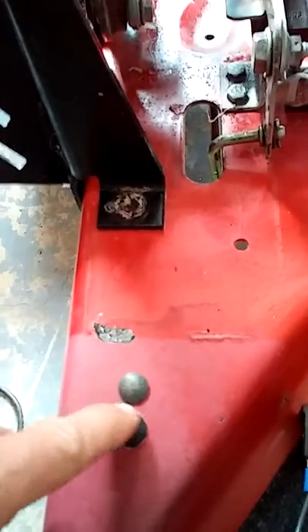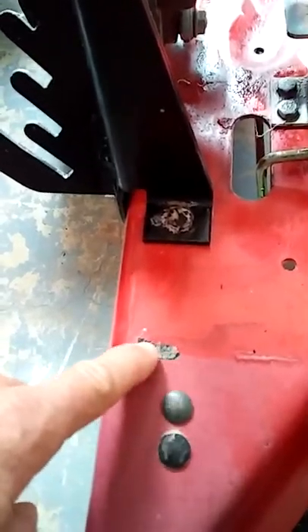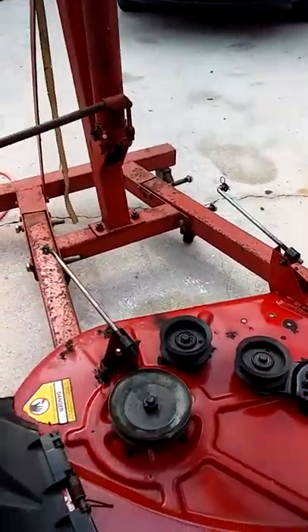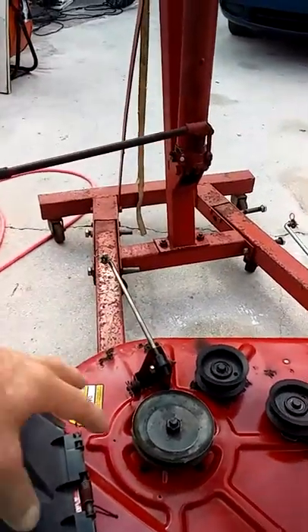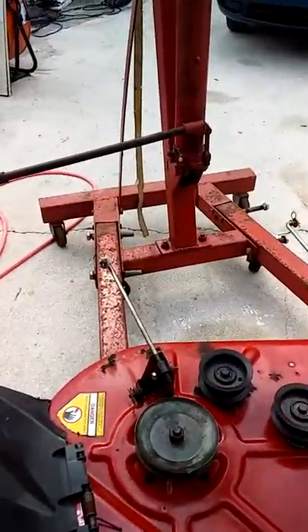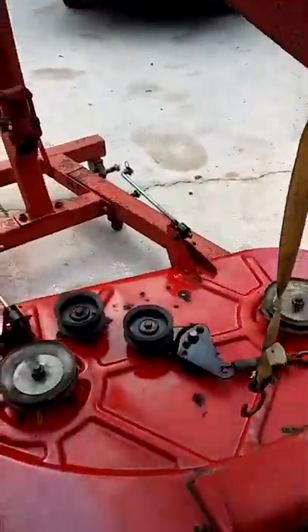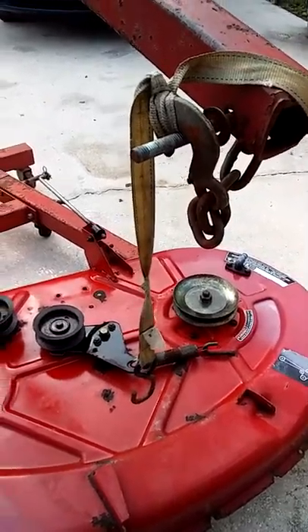There's one over here it's still working on — it's a little rough, I'll put some more on it later. But that one came out pretty good. It'll take and clean all the rust, neutralize every bit of it, so it'll stop rusting and save it. I've done under the mower too. Right now I'm going to pull it out and wash it. Parts are coming in for the deck — the blades just came in today. I'll take the spindles, idler, and belt tensioner off and do the same rust neutralizing and get it ready.